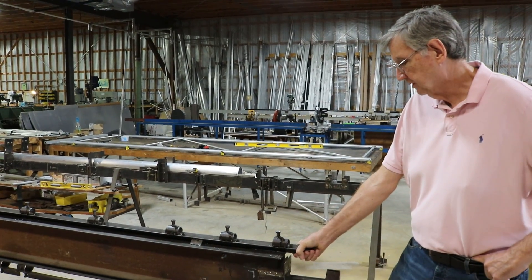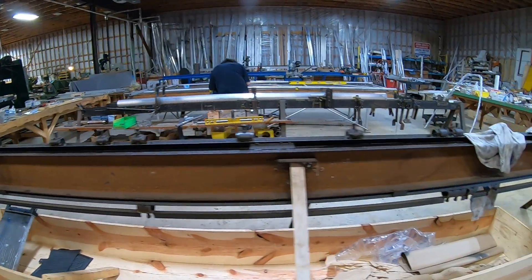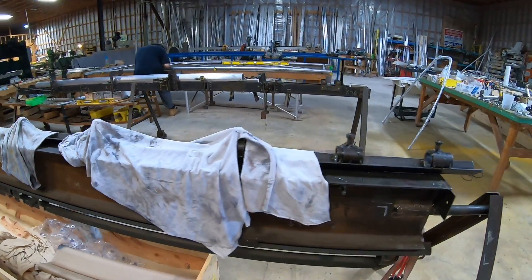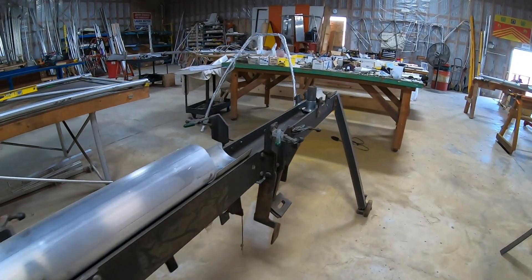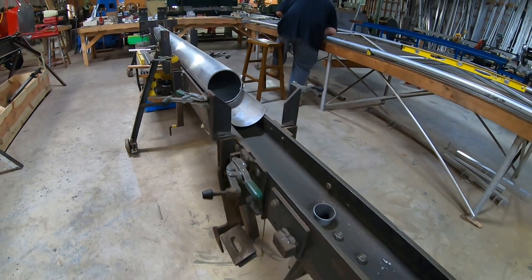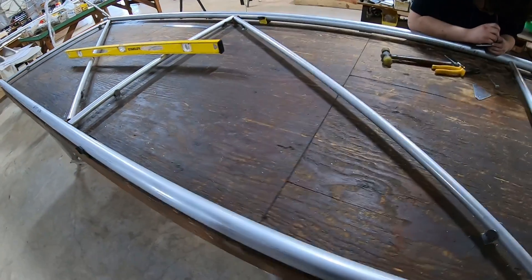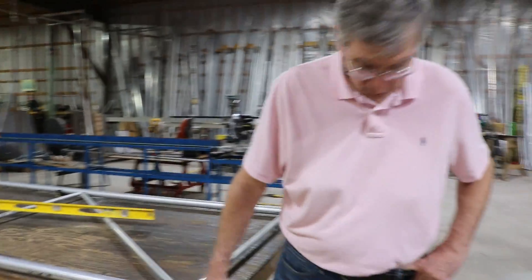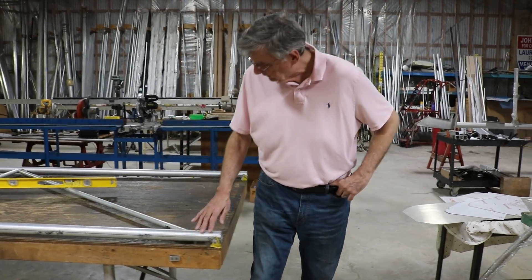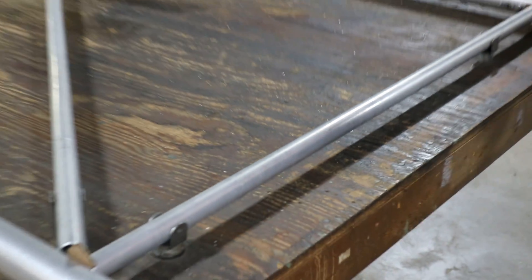In the middle of the factory building here, we have these long 15-foot-long jigs. This jig is used to build the flap around the main spar, and it's been precision welded in order to drill all the relevant holes. This jig here is where the body tubes are built up with all the constituent stations. This table over here is our wing jig table where the engineered spar has been pre-drilled for you. This is upside down because the left wing is built upside down — we use the same jig for right and left. We hand rivet each one of the 168 rivets that go into the wing panel to keep the structure sound.